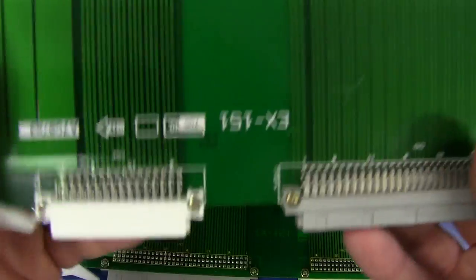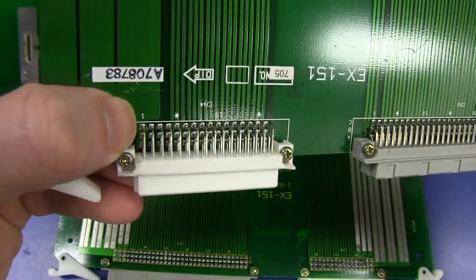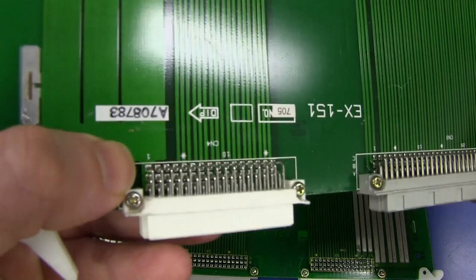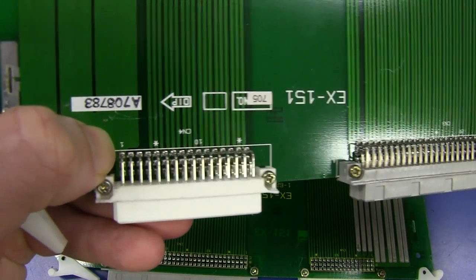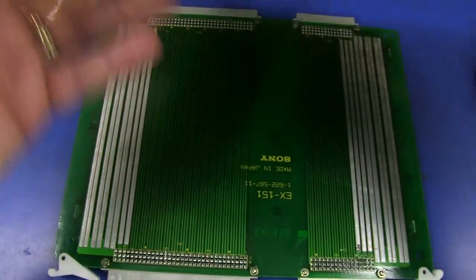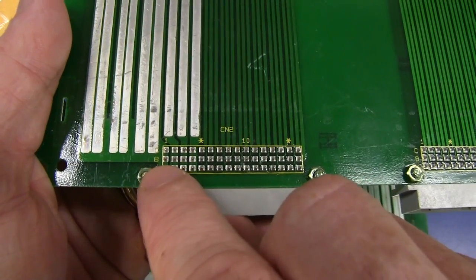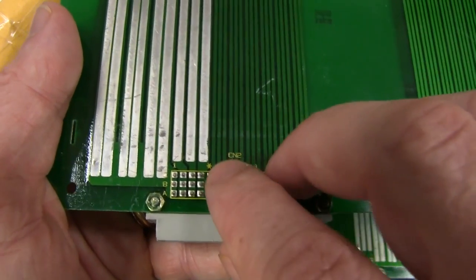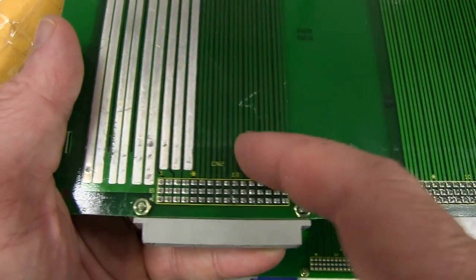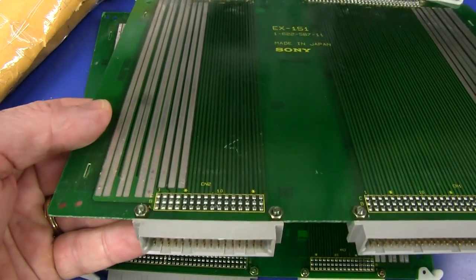The half-way could be very important because I've got a half-way version in the HP DSA for some of the lower boards in there, as you've seen in the previous video. Unfortunately, the reason this board won't work off the bat is because some of the pins down there are shorted together on the power bus. They've gone to a lot of effort - shorted those three pins together with huge traces. I checked the pin out on the HP DSA and those pins aren't shorted together - this is designed for a Sony custom pin out. Those first four columns of pins are all commoned up, so to get this to work as an extender card I'd have to get in there and break those connections. This is the only half-length, half-width extender card I've got, so I'm going to have to rework this one.